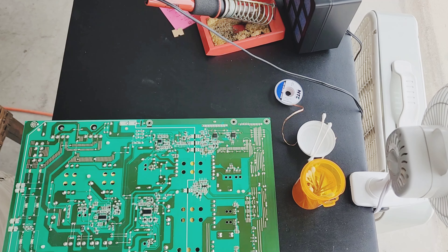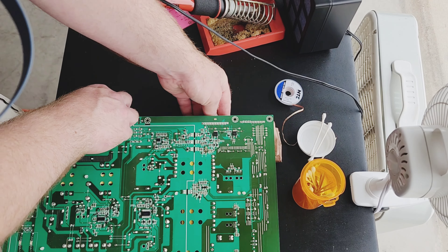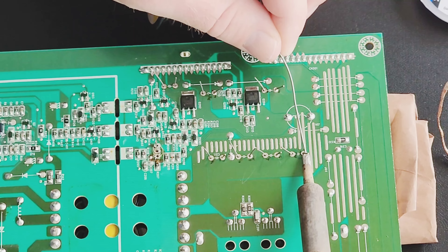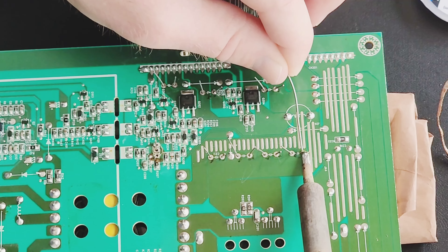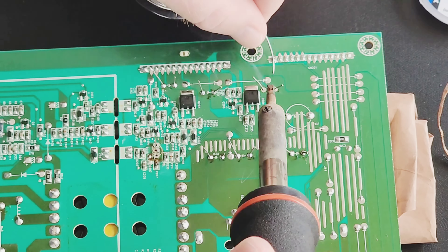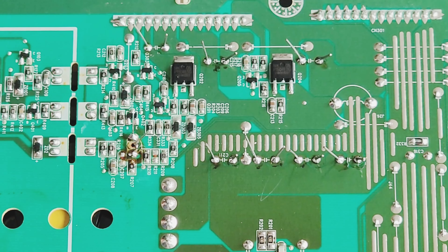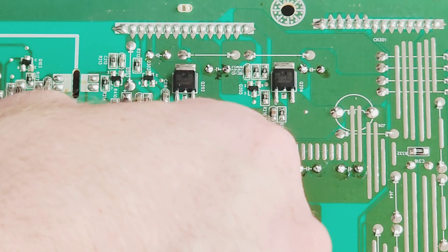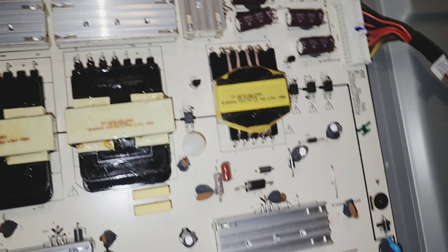Now everything's in place and ready to solder. I'm going to take some dampened paper and put it underneath the capacitors to keep them up against the board so they're not sticking out — flat up against the board. Now solder it in. I'm going to go clip off all the leads and then clean up the solder pads with rubbing alcohol. Even though that solder pad came off, I'm pretty sure there was enough of it there to make a good connection. There's what it looks like now that I'm done — got all my capacitors on there.